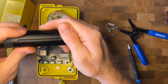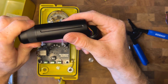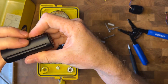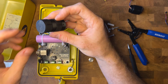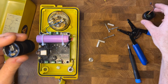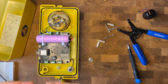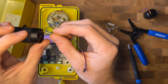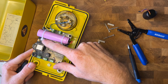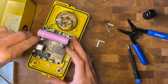With a RadView, you'll have a RadView capsule. Go ahead and unscrew the bottom and top of it. You can pull this out and push the RadView out — it's an internal capsule. On the bottom it has a four-pin connector. Included in your kit will be an extension wire; go ahead and plug that in. It won't let you plug it in the wrong orientation — if it feels too hard to press in, just try flipping it. Then plug it into either RadView port, RadView 1 or RadView 2. I'm going into RadView 1. This is the internal setup; you can also do an external setup.